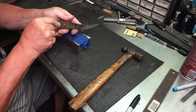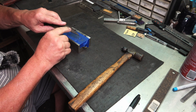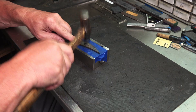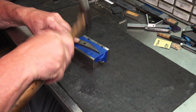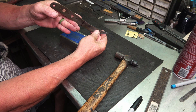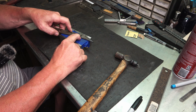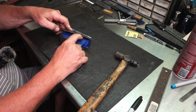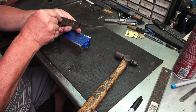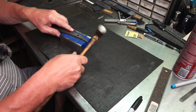We can check it — it's actually moving. It puts those little marks in there but that's to be expected; they're going to grind out. That's incredible. What you don't want to do is hit too close to your edge and damage it. Your spine over here — nothing to worry about. This blade is already nearly straight — just a little more peening.